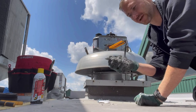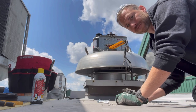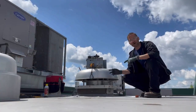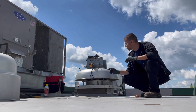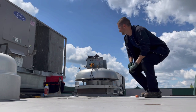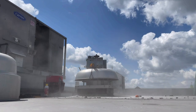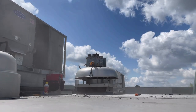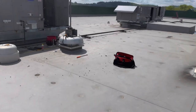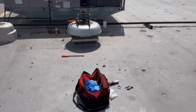What I'm doing is I'm removing a lot of this debris that's up underneath inside that impeller. Now, it can change airflow dramatically, also amp draw. Be sure to start by cleaning. Since I disturbed all that debris that was caught up underneath, there's still a little remainder in there. If I turn this fan on, it's probably going to puff out — so after I flip the switch, I'm going to run. Yep, dusty, very dusty. I don't want to breathe that in. That'll change your amp draw and airflow, definitely.